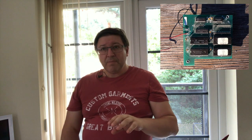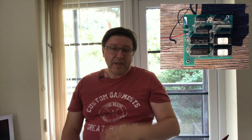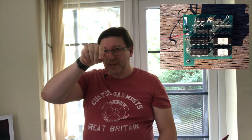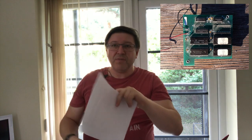I would visually inspect the pins — make sure that where the chip has been pushed down into the IC socket, no pins look bent or haven't correctly married up. It's quite possible that when you pushed the chip down, if a pin was slightly forward, it rode up and went over the socket and bent itself. That's very common if you're not using the right tools to put chips in and out. I've done it myself — that's why I went and bought the right tools many years ago.